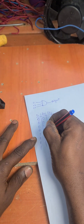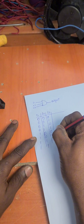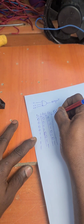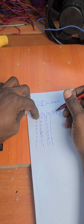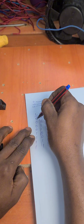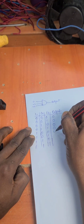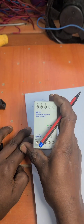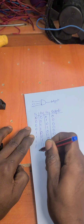So we're going to arrange these inputs — L1, L2, L3 — from different phases, and this is our output. We can only have output here when all these inputs are 1. 1 means on, 0 means off. So if we don't have all of them, we have 0. Here we have all of them complete: 1. What that means is that in a phase failure device like this, you can only have an output when all three phases are on.